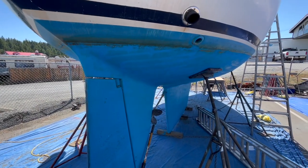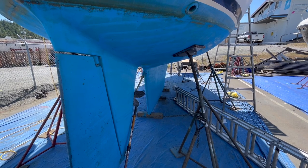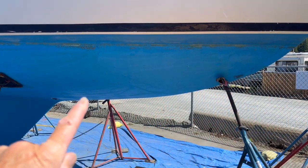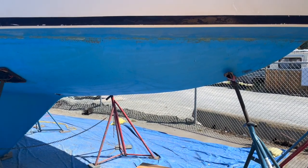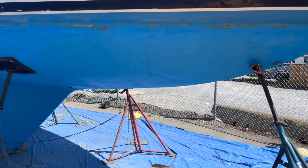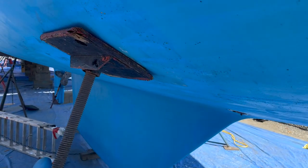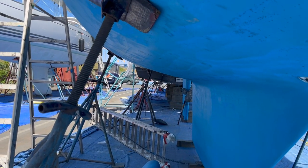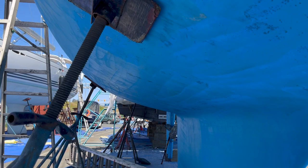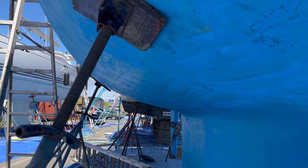In fact, this is a very fine hull — very solid, safe, and smooth, semi-performance sailing hull. Looking at the bow section of this boat, it's a much shorter section than a racer-cruiser would have — only about eight feet between the bow and the forward end of the keel, versus ten or twelve feet on a racer-cruiser. There's much more volume to this vessel, with little to no flat sections. This would be a very safe and comfortable offshore sailor, with big round bilges providing not only displacement and stability, but also storage and volume inside for tankage.